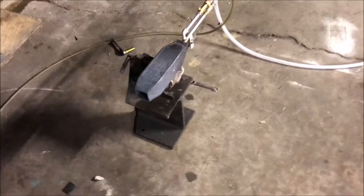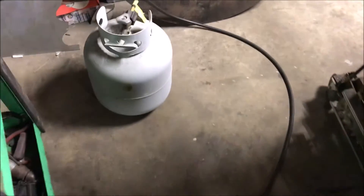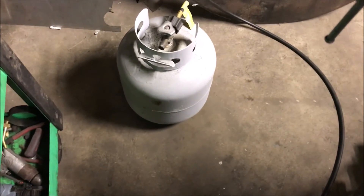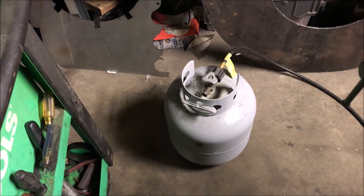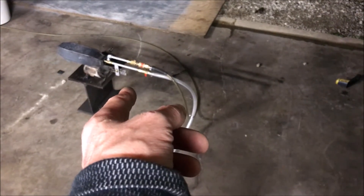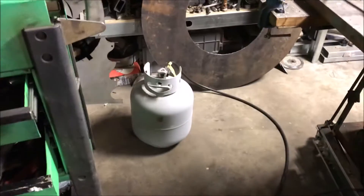I think we're going to stop this here for now and take a look at the footage. At one point I'm going to buy a scale so we can examine the flow rate of propane. This bottle was open full tilt. I purchased a blowtorch in the past — one of those wand blowtorches that claims 500,000 BTUs — which would lead one to believe that running this tank at full valve with the aperture sizes I have in this nozzle setup, we are at a minimum 500,000 BTUs, probably way more than that.